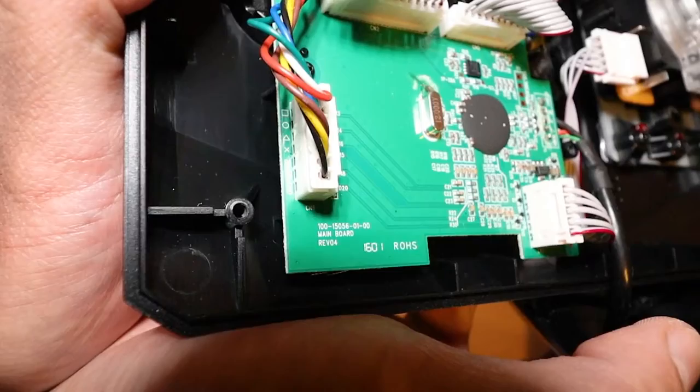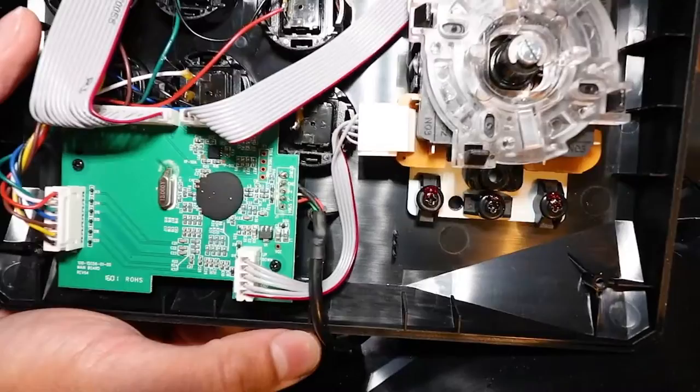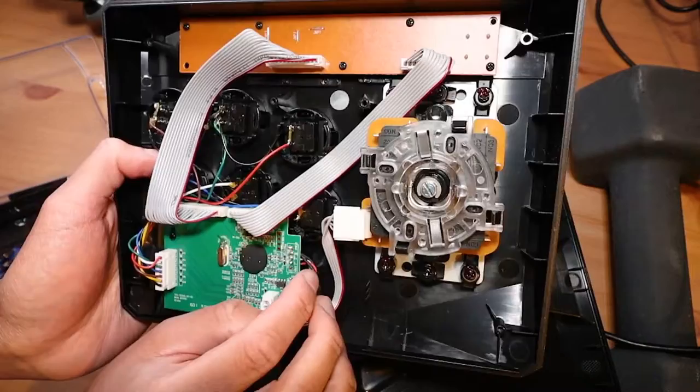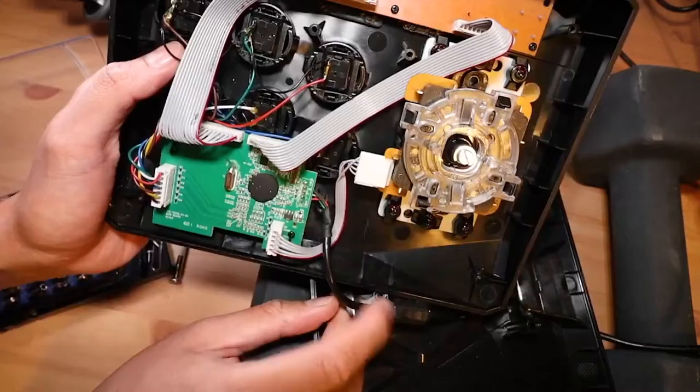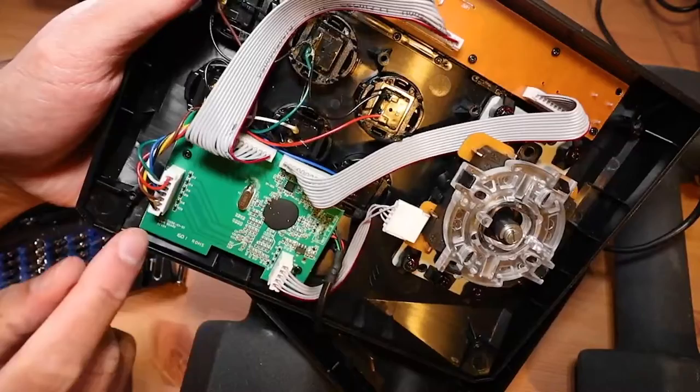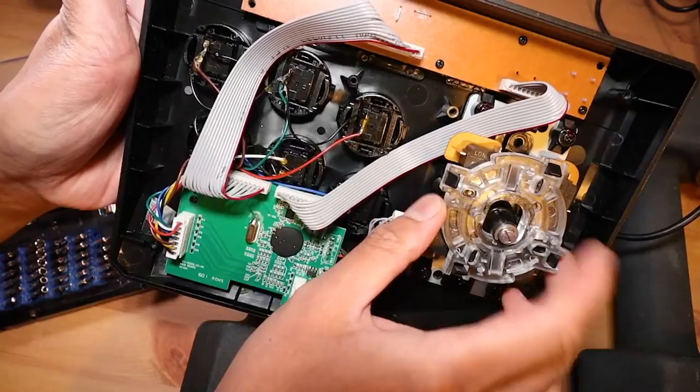These buttons should pop out — they are soldered into the wires and covered in glue or epoxy. There's a breakout board at the top for all the other functions. The connections to the breakout board aren't labeled, which is kind of crappy. However, in the connector for the main six buttons they are labeled, which is awesome, and they do have diodes. The joystick connector mounts with a standard JLF clone style mount. That part with VBus, data in, data out, ground, and shield is the USB cable — so I think you can mod it quite easily.